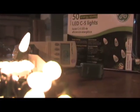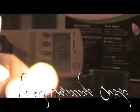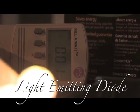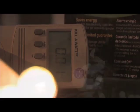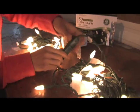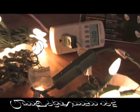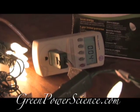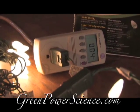This stringer is more expensive but a lot more energy efficient. These are LED light displays. This 50 bulb chain is rated at 3 watts but in actuality draws only 2 watts. I will plug in another chain to get us up to 100 bulbs. You can see this is only drawing 4 watts. These are 10 times more efficient and produce nearly the same light.